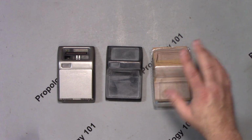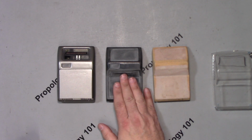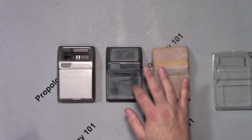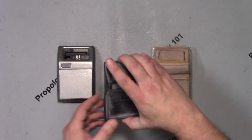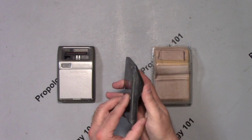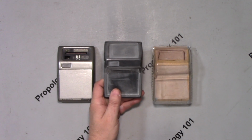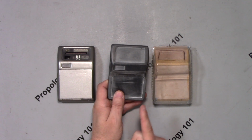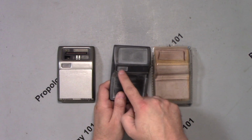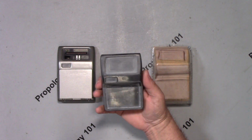So then after we decided what we were doing, we molded this and made this. This was a casting of this that we went back through, sanded, and polished to come up with this pattern, which is what we used to vacuum form the final prototype as far as we were concerned. We wanted to have windows up here like the other tricorders had, so you can get some light action going on here, as well as a screen here that you could still see.